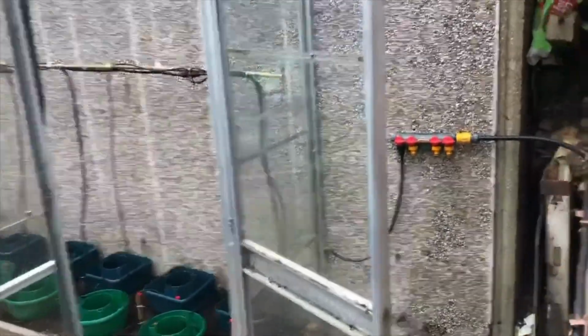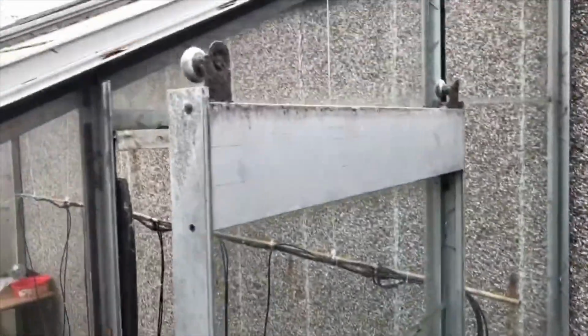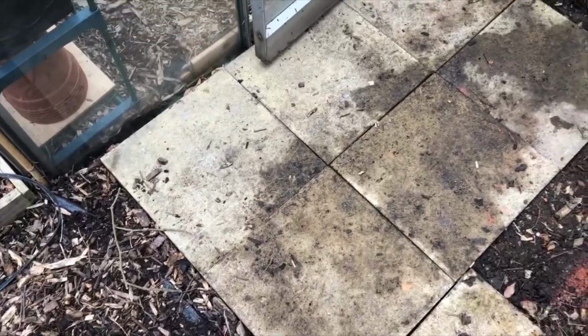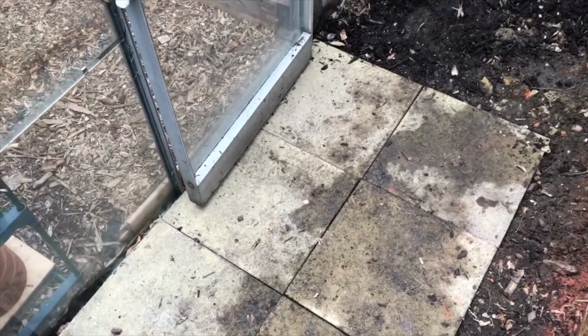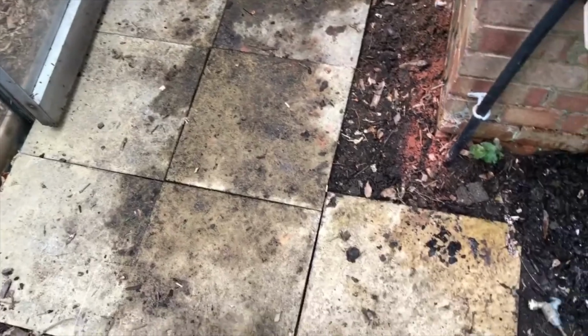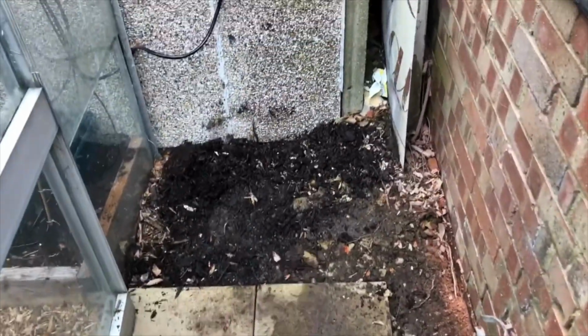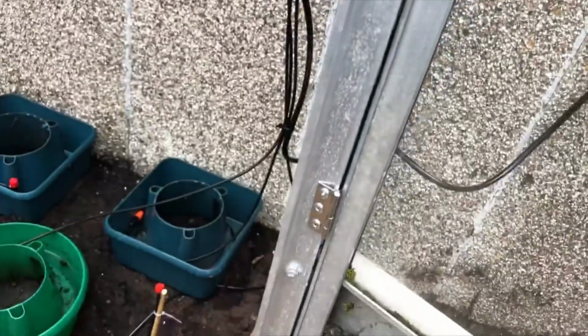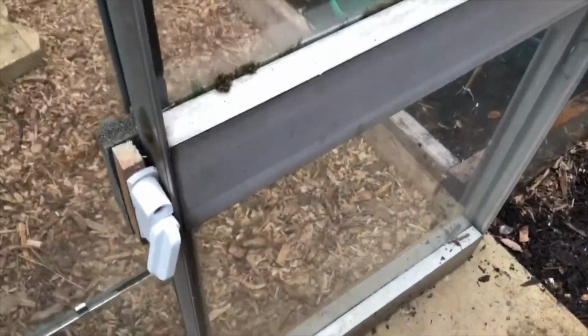It's been a busy couple of days, but I'm pleased to now show you the changes. So this door was a sliding door, and we made a few changes. We have dropped the depth of the bark down. Took out the slide mechanism completely. We put some slabs down. We have got another cover to get in down there, but we've now got an open and closing door, which I just riveted some hinges on. Made this little locking mechanism on the outside just to keep it shut.